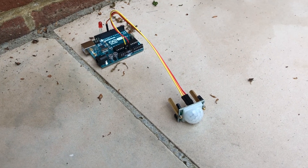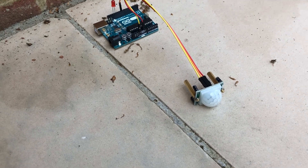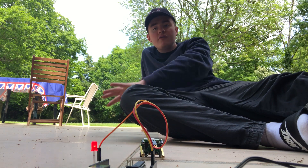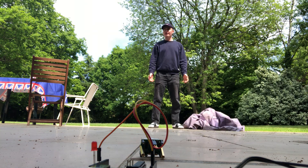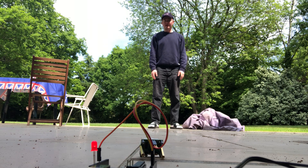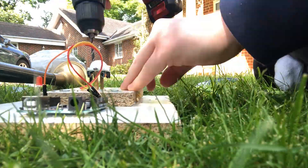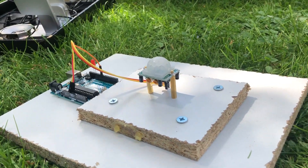This is the motion sensor I'm using — it's called a PIR motion sensor, which stands for passive infrared motion sensor. It detects levels of infrared radiation around it, and when something moves, it sends out a voltage. Here it is set up: it's off because it hasn't detected movement, but when I move — see, it turns on. I'm going about two meters back to test the range, and very quickly it detected that I moved and turned on. That's really good.